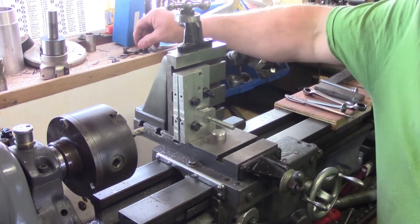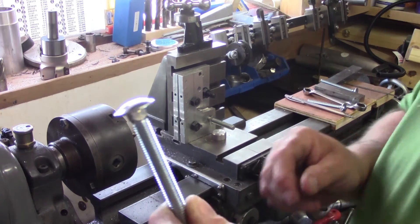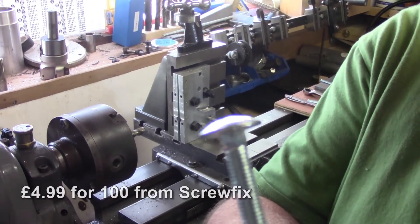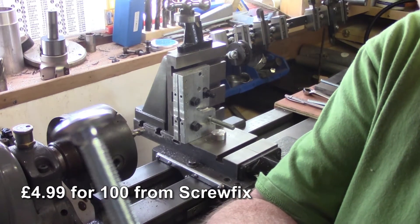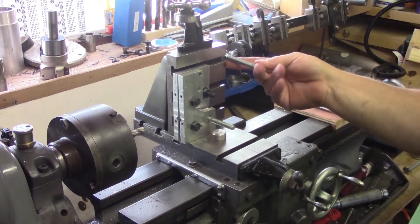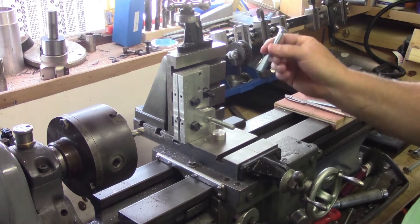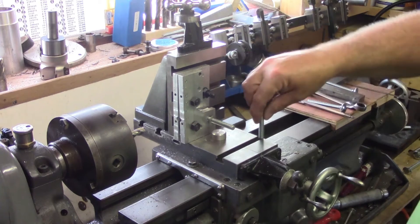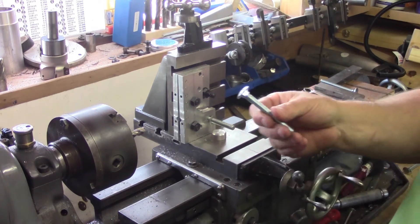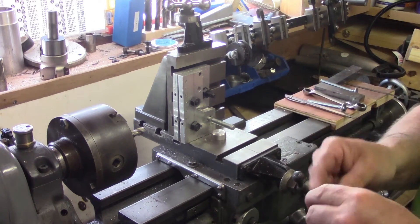The thing is, I'm always a bit short on T-bolts and they're actually quite expensive. So what I was thinking was, hopefully I could use these coach bolts. These are M8 coach bolts and the head on them is 20mm wide, so it's far too wide to go in there. But the slots are wide enough to allow an 8mm bolt to fit in there.